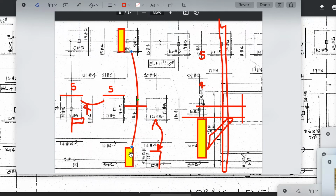That is clear. Cantilever behavior. Cantilever, cantilever, cantilever. All right? And now you look, these cantilevers, the concrete runs up to it. It's a rigid point. Some of it flexes, some of it doesn't. So very critical in this is that you see the offset.